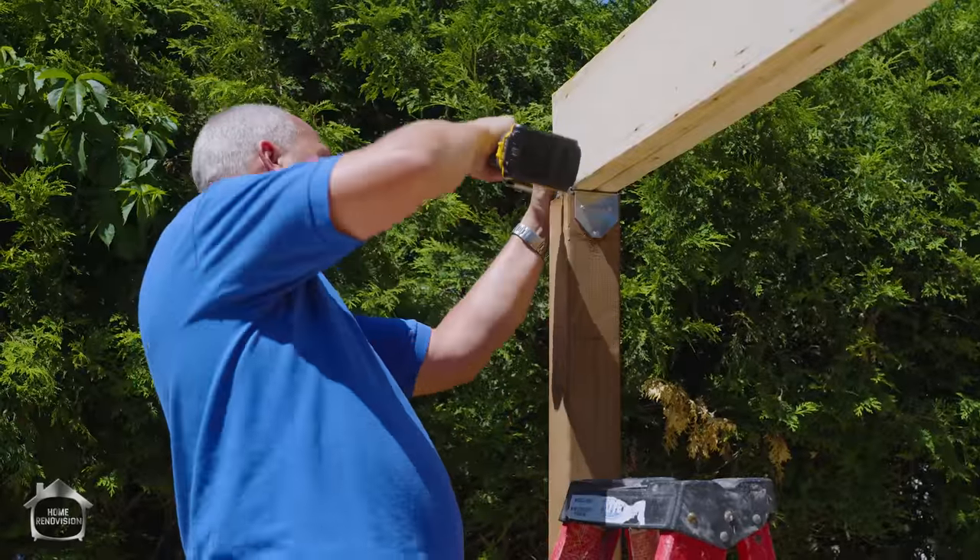We're going to use screws to put on our sheathing — three-quarter-inch plywood T1-11 siding. It's almost identical to the house, which is 40 years old. It doesn't need a whole lot of structure — I could put one of these horizontals every two feet. I don't need to go 16-inch on center; it's just a shed. I'm going to mark it off at two feet and four feet, marking the top of my board.